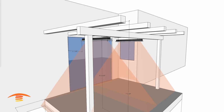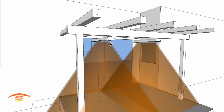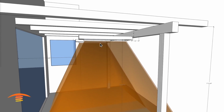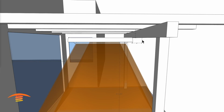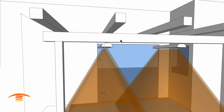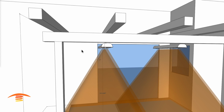And I'm going to take that off for a minute here and put in the hotter unit. So this is actually the WD model, but the CD model is exactly the same dimensions. And you can see we're meeting all the clearances. Again, it's 18 inches on the bottom side, 6 inches on the edge and 6 inches on the top, 6 inches all around the top, really. So it goes all the way around 6 inches, and then from here down it goes 18, 30, all the way down to 36, and then 18 at this edge here.